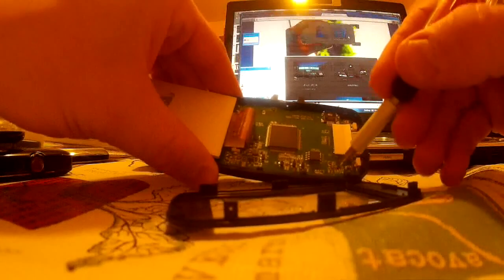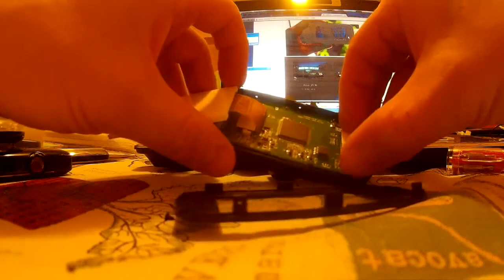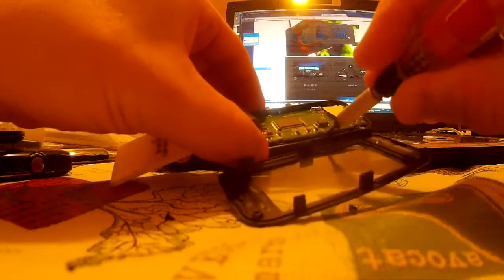I'm trying to pick out the last screw — it fell inside the case. I'm going to open it up now, prying it out carefully. As you can see, there are some things holding it to the other side. There's going to be a flat flex cable connecting the PCB to the camera module, which is what you see there in white. There's also a couple of wire pairs — black and red — one going to the microphone and the other to the battery pack. You can see the flat flex at the bottom, that white flat cable.